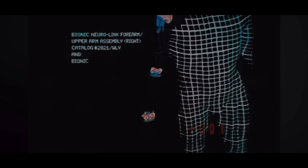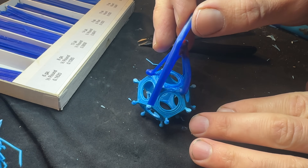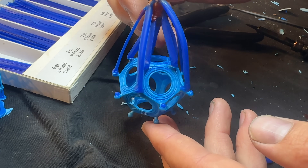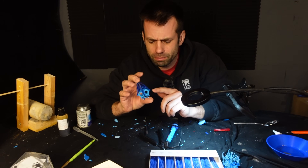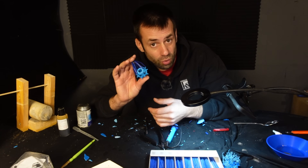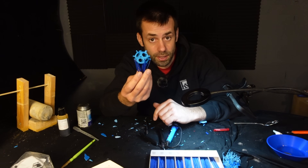No problem — we will rebuild them, we have the technology. What I did is I added a sprue to each peg where it was flat on the bottom, so that'll become metal. When I cut the sprues off, I'll just reshape that metal into a round peg. And where there is that small crack, I took some wax and filled that in and tried to draw that little circle back onto the piece. Maybe not as good as the Romans did, but I think it'll work. So now let's invest it.